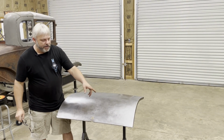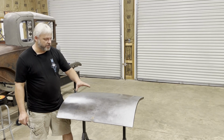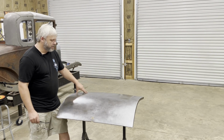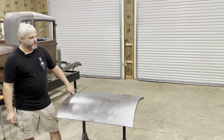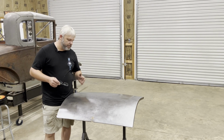All right, so that big dent's fixed, the corner's welded up, and that's done. All that looks really good. Then I went ahead and dollied out a few of those dents that were in that section there. I've still got to bring a stud welder home and get some of the deeper ones out that I just can't get to up inside there. So I'm gonna bring a stud welder home and do that at some point, maybe next week.